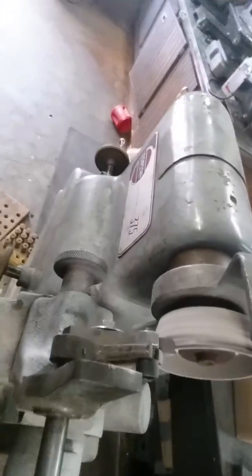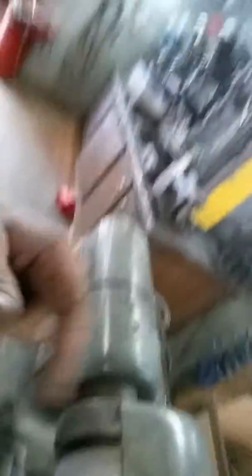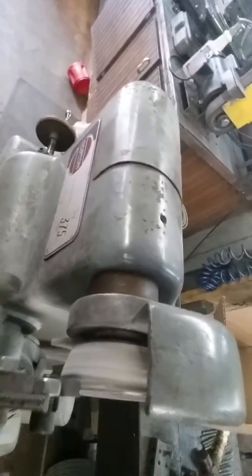I got it mounted and we're grinding. The closer I get to the center of this, the smaller the radius; the further I get away, the bigger the radius. And I dress the end of the grinding wheel. It don't look like much now but if you'll bear with me I'll show you the finished product. I was shooting for just about a quarter inch radius, or just slightly under that — 15/64.